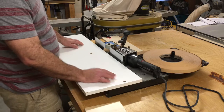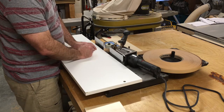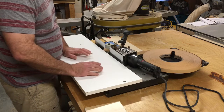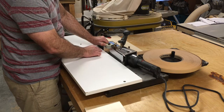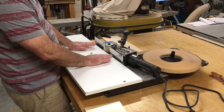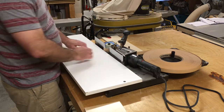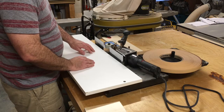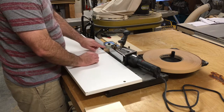Another thing you need to do is make sure the table is square to the wheel when you're pushing against it. The wheel has just a little bit of flex, so you want to push against it like you're feeding a piece through and have it be square to the table at that point. To do that I had to shim up this edge — raise it a little bit. You can use playing cards since those don't compress. I also added a screw in the center because it was bowing up. This pulls it down tight to the shims, making it straight and square to the wheel the whole way along.